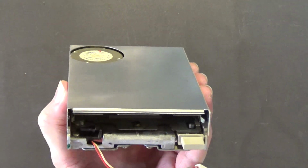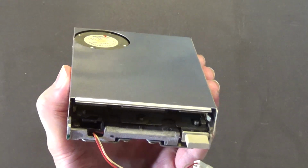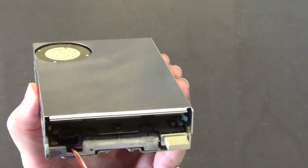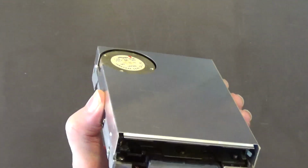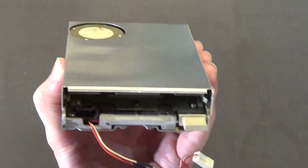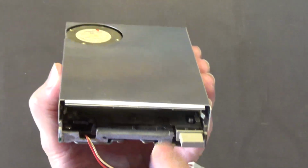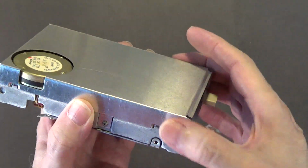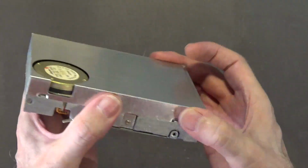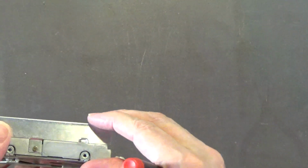because the power supply fan pulls air through every opening of the Amiga 1000, including the disk drive opening, and it pulls the air through that power supply. That's the reason why the drives get dusty, because this is one of the openings that pulls the air in.